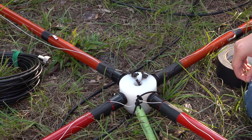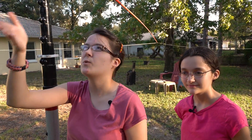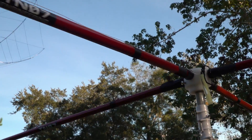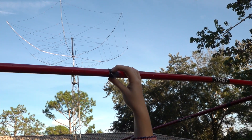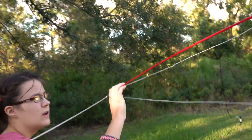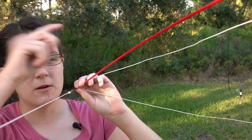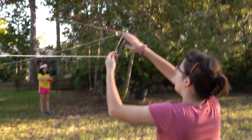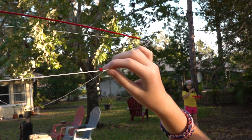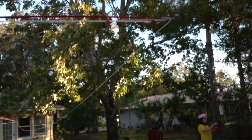We're going to be putting it up on the mast, and once it's up there we can show you what we do next. On each intersection, and at the start, we wrapped gaff tape around to keep this wire in place, and on these sections to also keep the wire in place but also to help the sections not close themselves. We have the wires all going down, and once you get to the end they got connected with string so that they all stay pretty even. The knots that are either red or black — that means they're supposed to be there, so don't take them out. If they're colored in some way, we know they're supposed to be there for it to be positioned correctly.